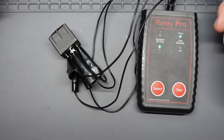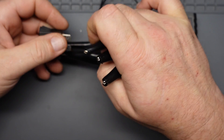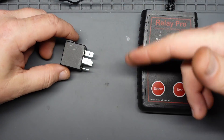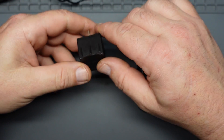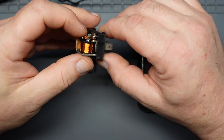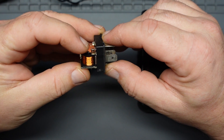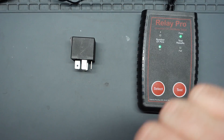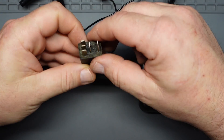We got a pass — it's a good relay. The way I think it works is it pulses those contacts back and forth, and once it figures out the configuration it clicks those contacts open and closed what seems like a little over a dozen times, basically checking for welded or stuck contacts.